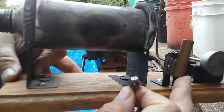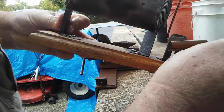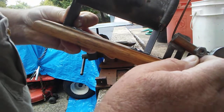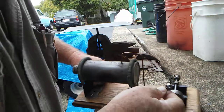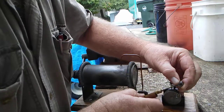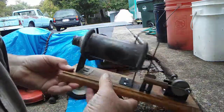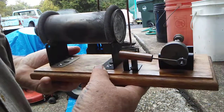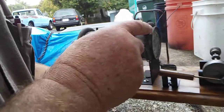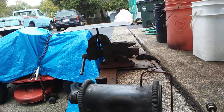Here's a better view of the two holes — the intake and the exhaust holes. When the cylinder is lined up with the exhaust hole and it's coming around, it pushes out the exhaust. Then it goes down and lines up with the intake hole, and pushes it out on the power stroke. Then the momentum brings it back. I put the rod back — piston and rod back in — hit it with a little WD. One of the things I did that was a mistake but I never corrected: I shouldn't have used this screen door spring. It sucks the heat away. Not a good idea.